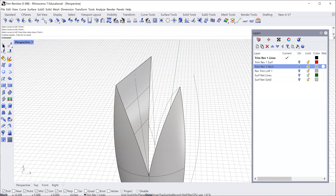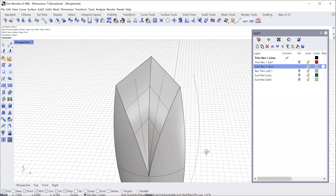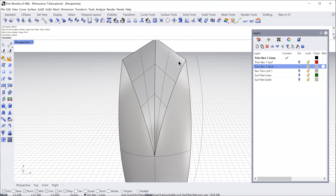Since I know this is perfectly symmetrical, I'll go back to front view and mirror that over. Using the mirror tool, I snap to a point on center here and up to the top — now I know I have that lined up. Back in perspective shaded view, I have those two pieces coming in there. All these hard edges I'm creating are going to be radiused. I did this several times and went back to make sure I could radius them — this is a very sharp point that needs filleting.